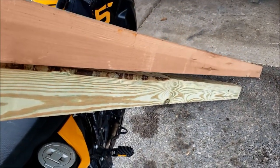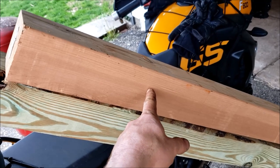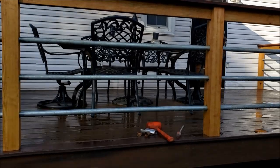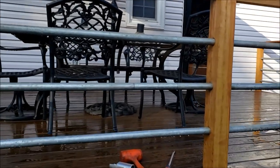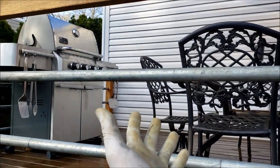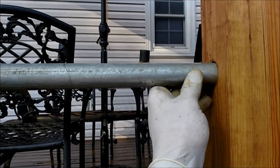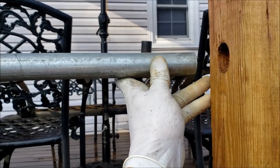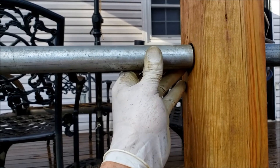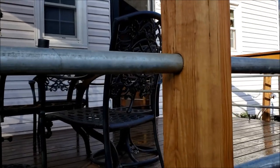The only reason I didn't use cedar is because I feel it's too soft and the nut and washer inside would eventually keep sinking into it. When I say this deck's done, it's actually not completely done — there is one last thing I need to address. These poles are just sitting in here superficially, not secured in any way, and I made them a little bit short so you can still slide them out and remove them if you ever want to replace a post or paint the poles.